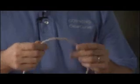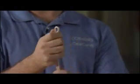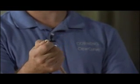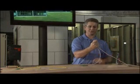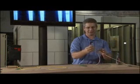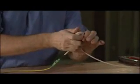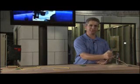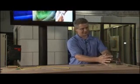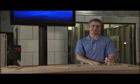This is what we call a ruggedized drop — a larger outer diameter cable designed to self-bend limit the fiber inside. I can take that drop cable and pinch it over on top of itself, and you're not going to see any additional loss. I'm also not worried about the mechanical reliability of the fiber inside; the cable is there to protect it. Think about how often this happens in a multi-dwelling unit — people take a bundle of cable, fold it over on itself, put a tie wrap around it, and shove it into an outlet box. With standard fiber that's a big problem, but with this I can squeeze it down tight with no appreciable impact to loss and no impact to video quality.